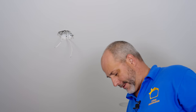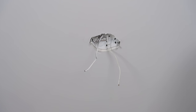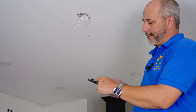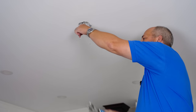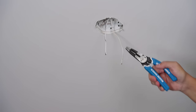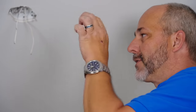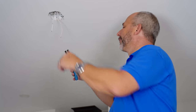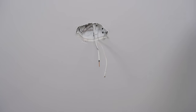Now let's expose a little bit of that wire — this is black, believe it or not. If you buy one of these multi-tools it's very handy: it's a cutter, a stripper for the wires, and it's square-ended so you can twist wires together. We want to start fresh. On the side there are numbers — wiring in residential homes in North America is always 14-gauge wire. The bigger the number, the smaller the wire — kind of like golf, where a low score is better.